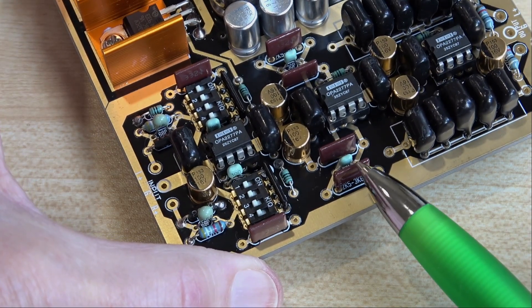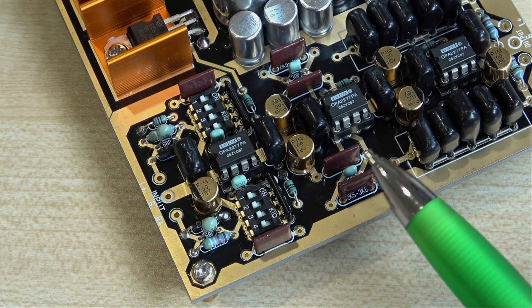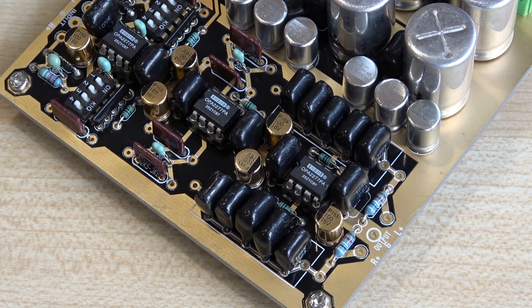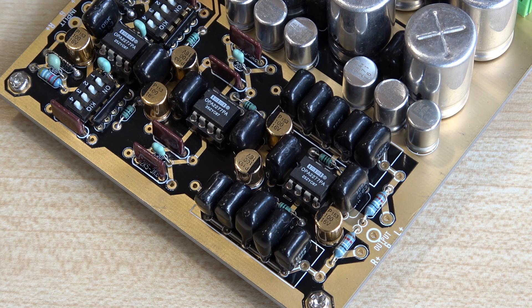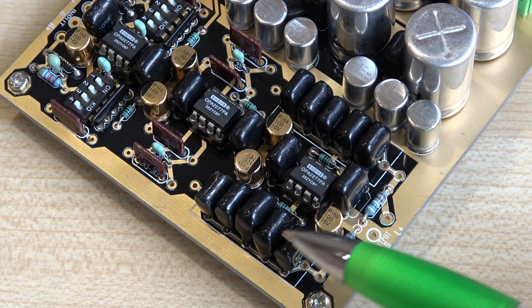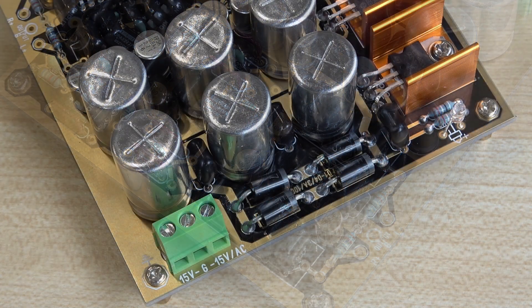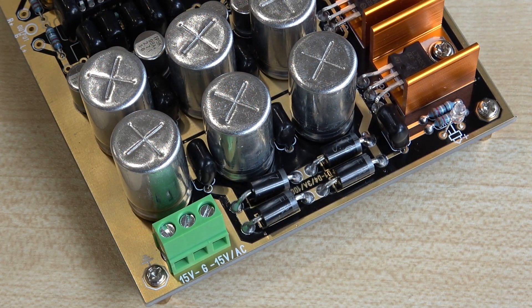There are four of those altogether that set the overall gain of each stage. To say they've gone overboard on capacitors is an understatement — I've never seen so many capacitors on what is basically a simple circuit. They've gone through every textbook placement: there's one bridging every single electrolytic, and others whose purpose I haven't traced yet. There are bucket loads of them.